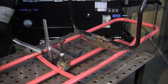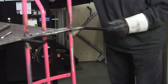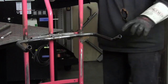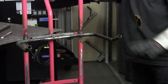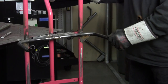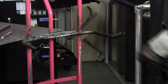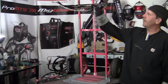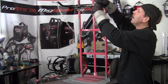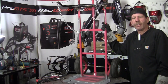We're just about there now. Here's the top piece - I put the little gussets in here to give it more support. I got to hit it with the wire wheel and then we'll run our chain across here. There's already little holes there. There's a lot of other things you could do but this is good enough for the shop. We don't even use the oxygen-acetylene torches that much anyway - we're always using the plasma. It's good for any kind of bottles, propane bottles too. A little paint will make it look nicer. There's your bottle cart - got the chain on there, easy access, take it on and off. I'm Rob, thanks for joining me at Longevity Learning Lab, we'll see you next time.